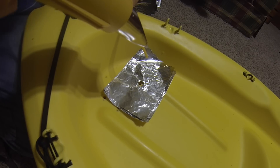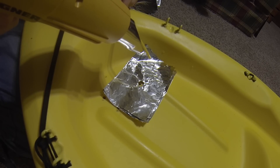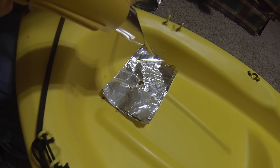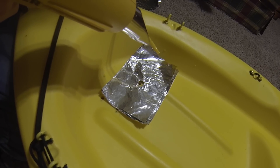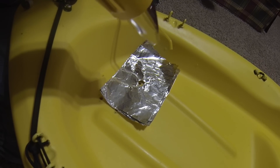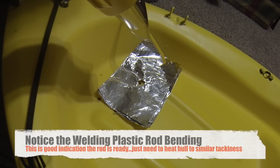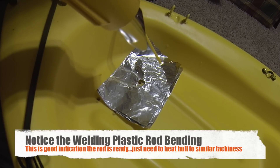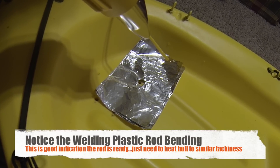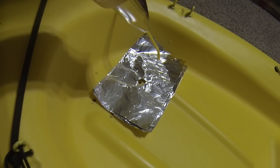You don't want to burn the plastic — you just want to slowly heat it up. As we heat this up, you'll see a change in color, and you'll notice that the rod begins to bend. Keep the heat gun at a distance because you don't want to burn the welding rod — that'll cause discoloration, which means it's getting too hot.